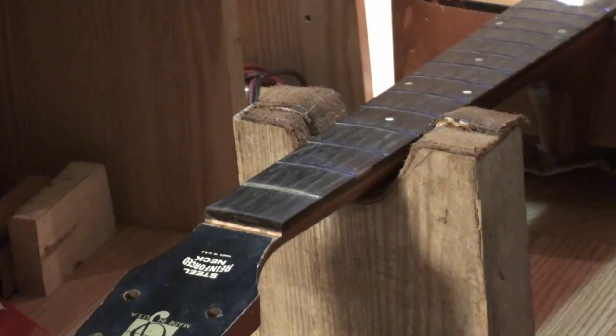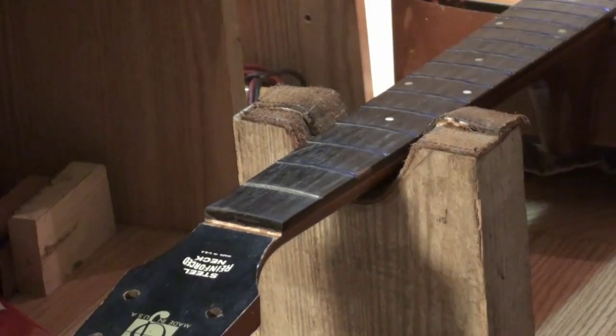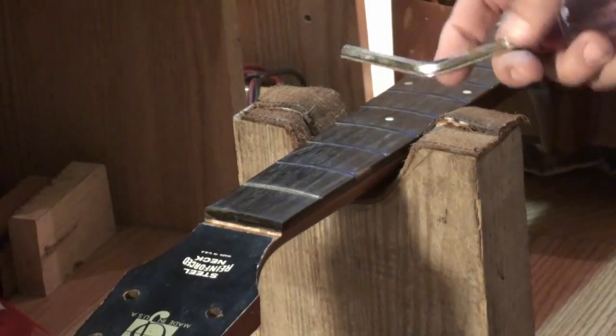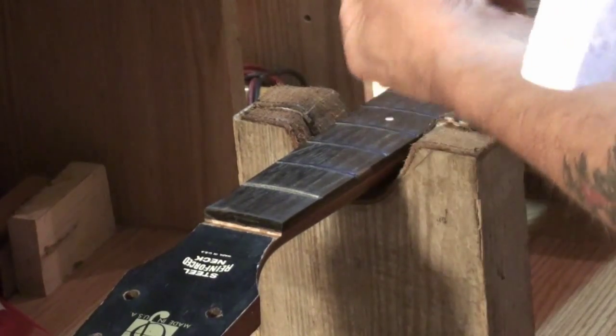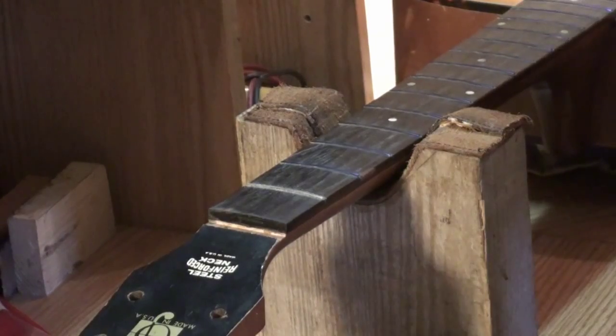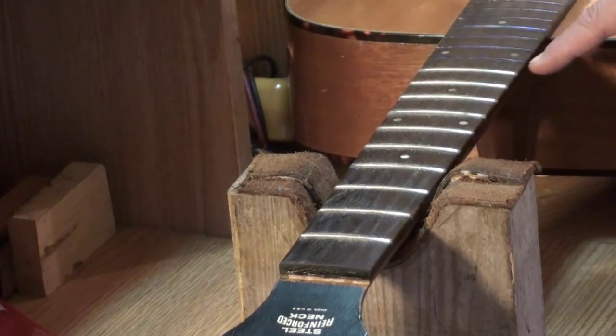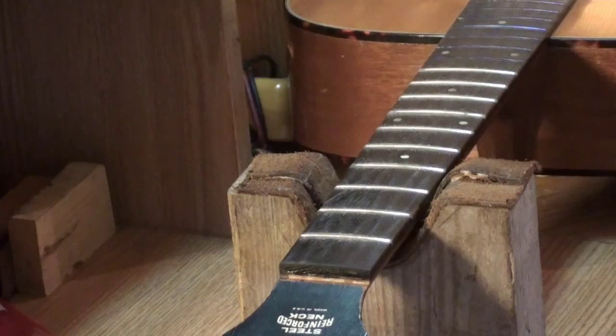You're looking at probably an hour doing this with both grits. I've got to go get some magnification — I've got to get glasses, because I'm old and blind and can't see anymore! You can already see the frets that I have crowned down to right here. I'm going to show you something: the frets down there are still marked blue, and up here where I've been working there's a thin line of blue left on the tops.